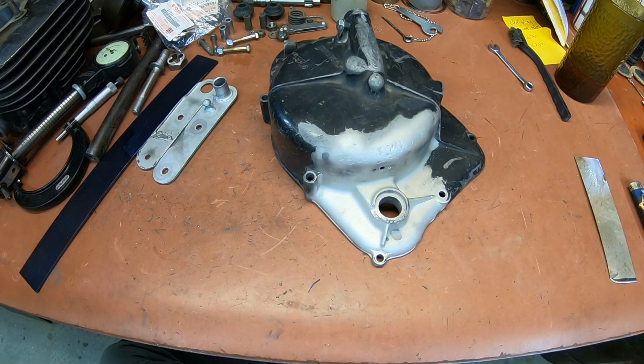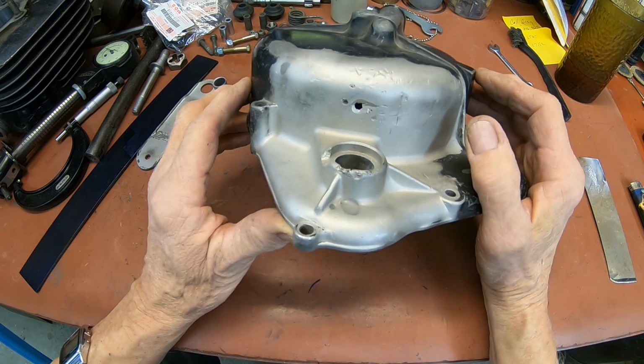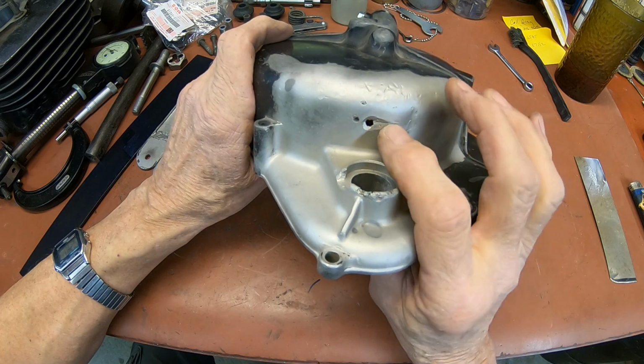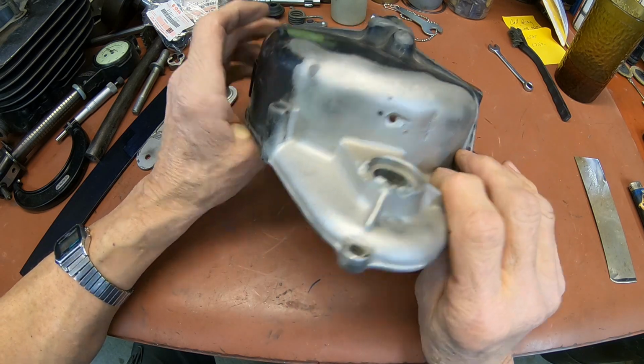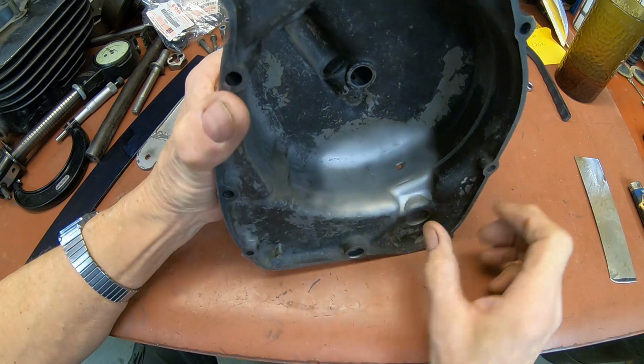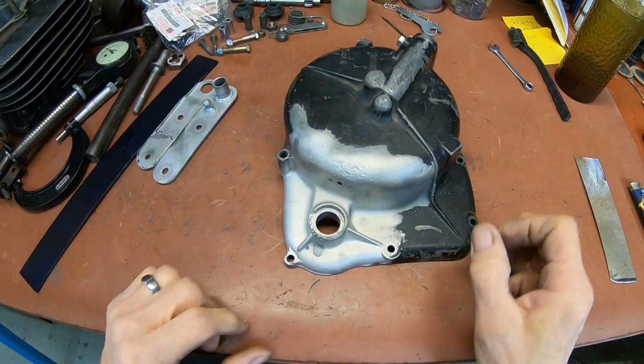And in this case, let me grab that rod real quick. I believe it's 92. Yeah, it's ERAZ92A. And Wyatt said that that was a very good all-purpose rod for magnesium. If you've got different compounds or whatever, there's some that might work better. He also said that if you could weld on both sides of your weld, it will prevent warping. So that's what we're going to do, and that's what I did on this gentleman's case that he sent me to practice on. We'll weld in here first, and then we'll come back out here and weld the outside. And then we'll go ahead and see if we can fix this portion right here.